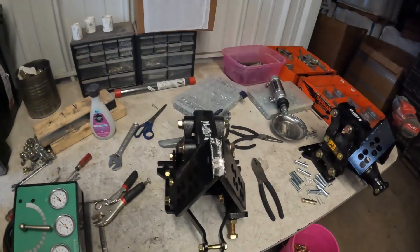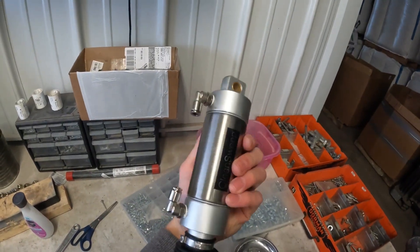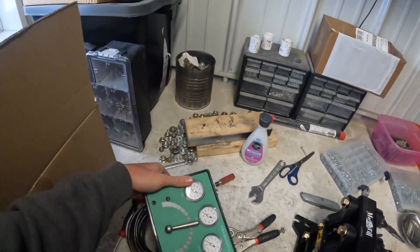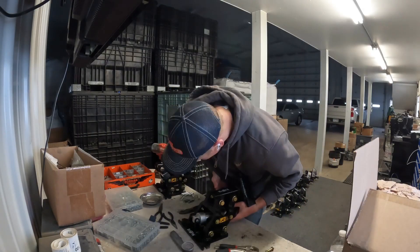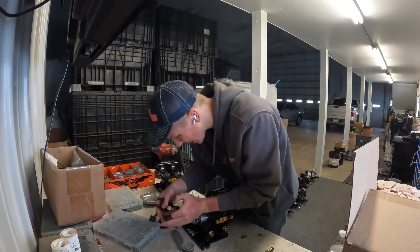What I'm doing is taking these row cleaners - these are the row cleaners without the side spikes on - and I gotta add this air cylinder and put it inside here. These row cleaners are gonna go on the front of the row unit of the planter and clear out the trash and debris. I'll show you when we get in the other shed what that's gonna look like. Once I get them all done and installed on the cab, this is the control module where you can control the cylinder for the down and the up, depending on how low and high you want them.